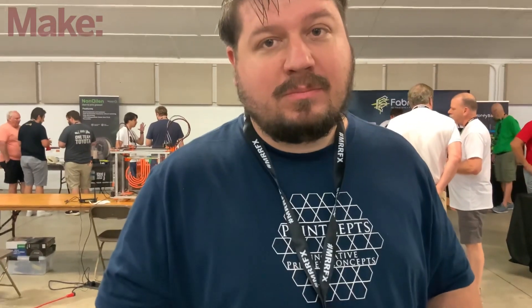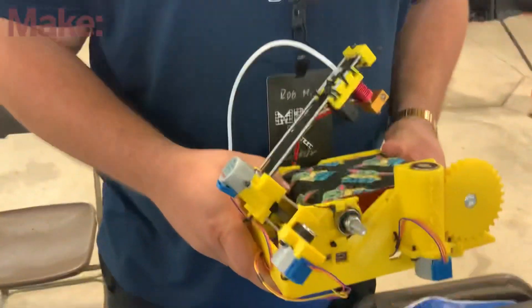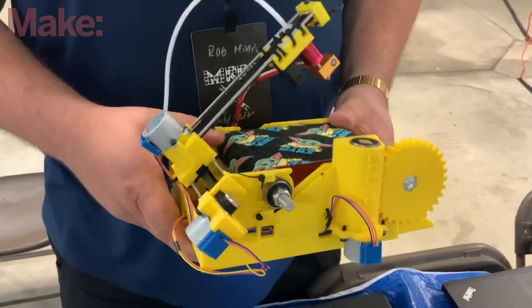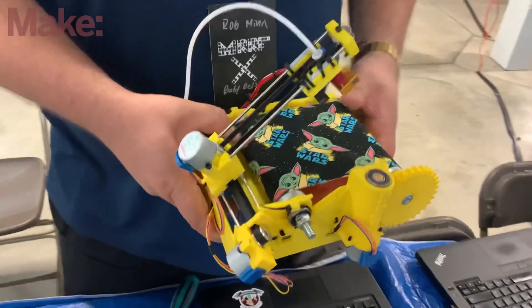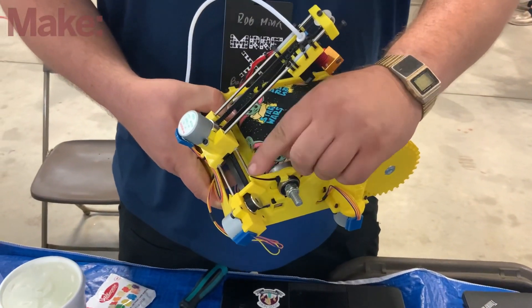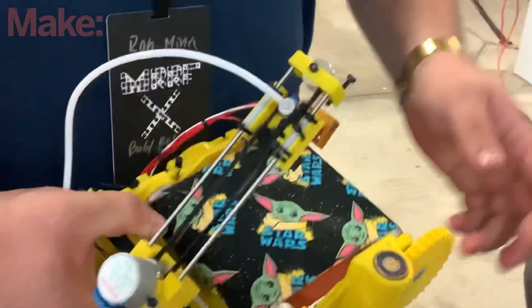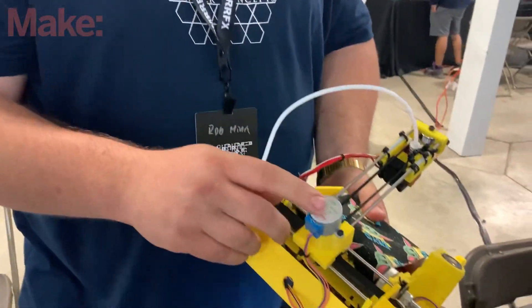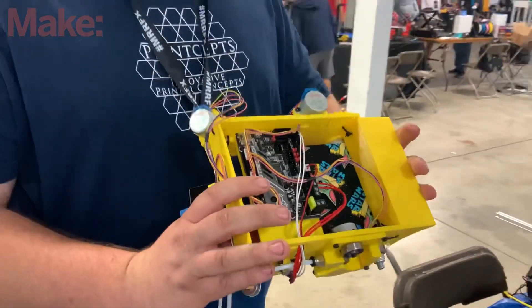So you said about $100 in parts — I see there's a lot of 3D printed stuff here. What are the parts you have to get? Just in general, don't worry about being exhaustive. About 20 M3 screws, a handful of zip ties, M3 rods with PTFE tubing as the linear bearings, a bunch of 608 bearings, the cheap 28BYJ-48 stepper motors, and a control board.